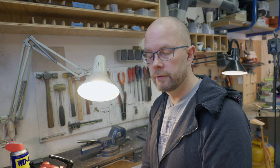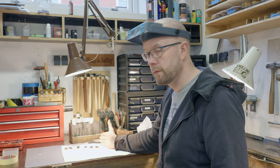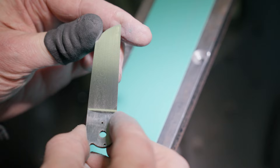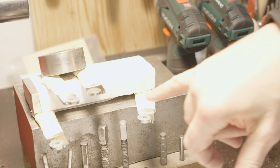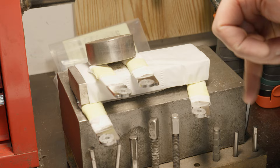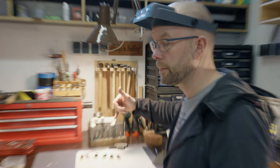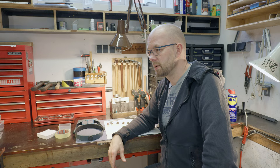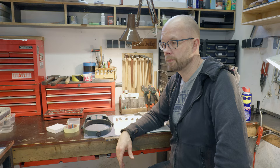That was the last of the finishing touches on these blades. Next up for this batch is engraving logos. These are the blades we ground a couple of days ago — I already finished those. These are Damascus steel and I masked off some of the internal areas of the blade where the mechanism will need clean steel. Now we're going to mix up some sulfuric acid, which is not for the faint of heart. You really have to know what you're doing — don't try this at home.